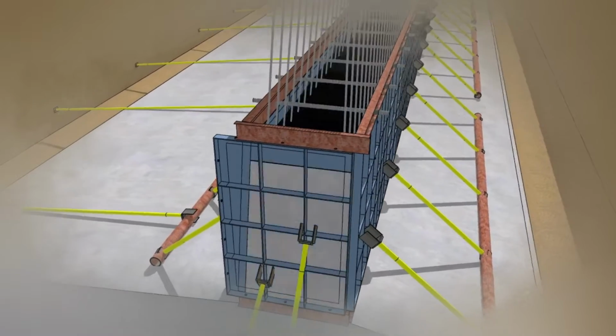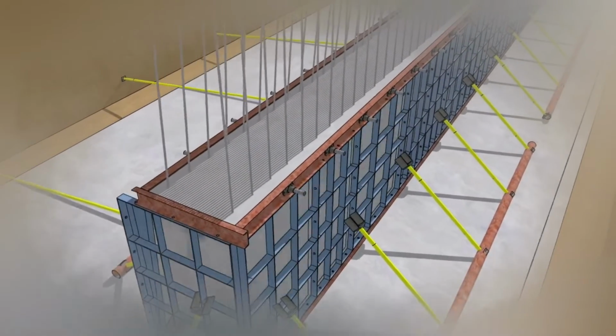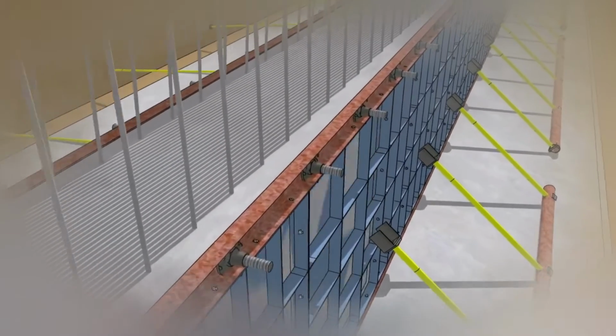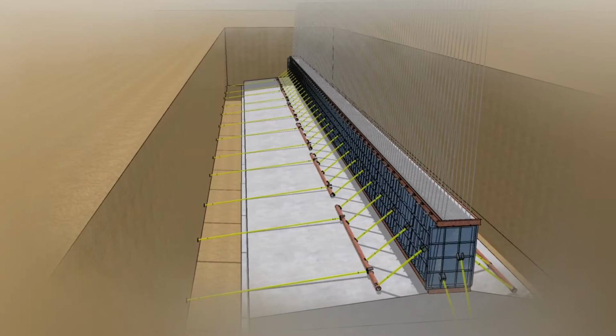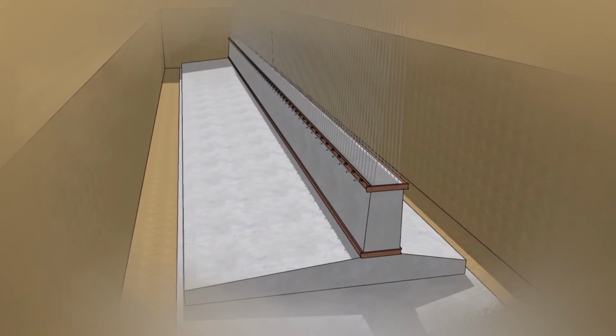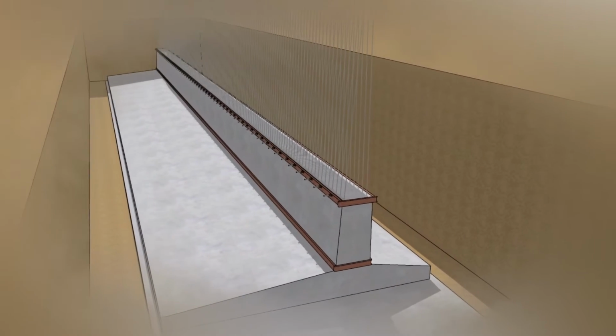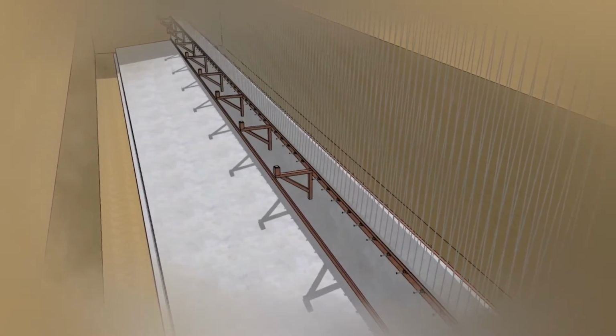After that, concreting is done for the first lift of the retaining wall, with the help of required tools and equipment. After concreting of each lift, de-shuttering of formwork material has been done. And in the same way the other 3 lifts of the retaining wall have been constructed. Supports are placed for construction of the second lift of the retaining wall.